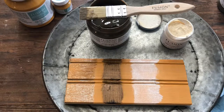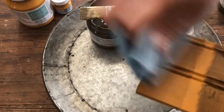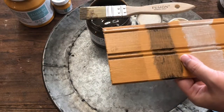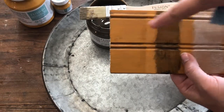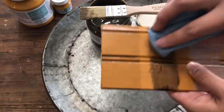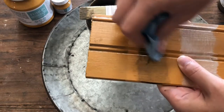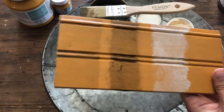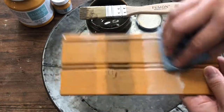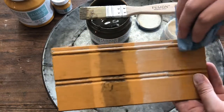Now I'm going to go ahead and wipe back my glaze, just using lint-free cloths — the disposable ones you can pick up at any big box store. Right now it's still wet, but when it dries you'll see that it's obviously changed the tone. Now I'm going to wipe back my black wax. It's hard on this tiny little surface, but you guys are at least getting an idea of how it changes. The liming wax hasn't been on very long, but we can still kind of see — as it sits in the recessed areas, you can allow it to pull so you get more of that impact.